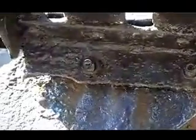And then you just come under here, get a rough idea. This hardware isn't as bad. There has been some work done down here. You can see on this, for instance, the clip is starting to rot out. And over here, you can see the clip is bending out. So there's different issues, and some of this has to be reworked and addressed properly. And then the last issue, it's not quite clear because there's paint, but the mortar is starting to come out. There's some bleeds on this side, and it's where the connections are. We need to address some of the wall issues. A little bit of masonry work to be done there.